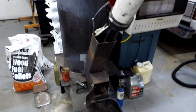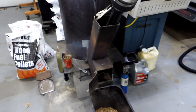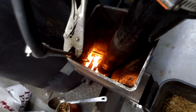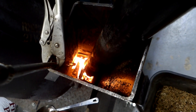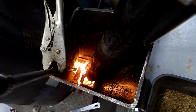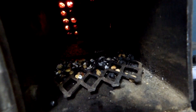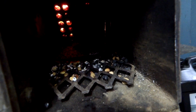It was a challenge because I had to cut up all the wood into small pieces, so I figured out a way to burn wood pellets. That's what I'm doing now and have been for three years — I just buy pellets and cherry pits. You can see down in there I made up a burn basket out of some angle iron, welded it together, and drilled a series of 3/8-inch holes through both sides. You can see the holes, and both sides are identical.